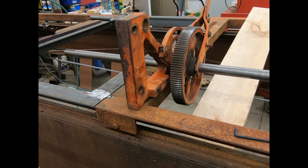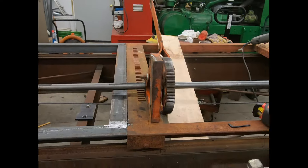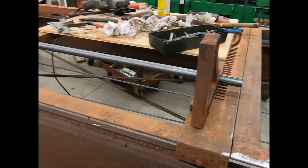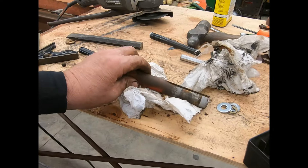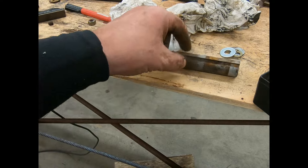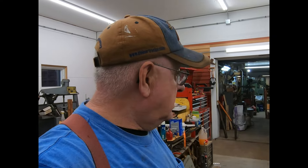I'm pretty happy with what we've done tonight. One new shaft sticking out — got plenty of room to put the gear in and get the key in afterwards. This one here is lined up about right. Key goes all the way — just barely, but it's enough we can get to it and oil it. I was worrying about that keyway going in and wearing on the bushing here. But you look — this is where the gear was, and this is where it turned inside the shaft. They had the whole thing inside there. Apparently it doesn't make much difference, as long as it's not hitting that brass pin, which I don't have in there yet — that one was missing the pin.